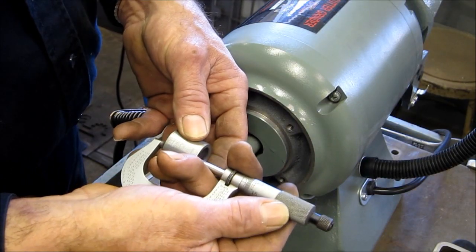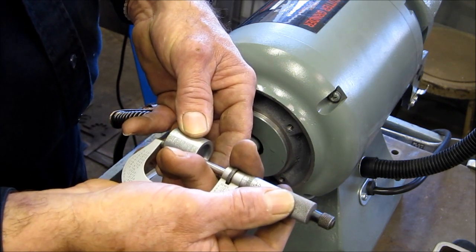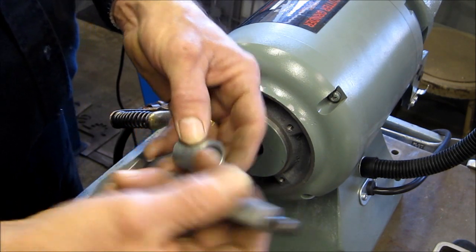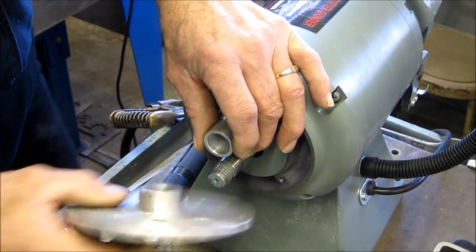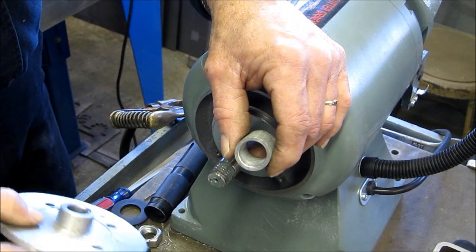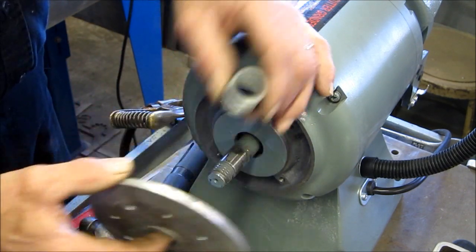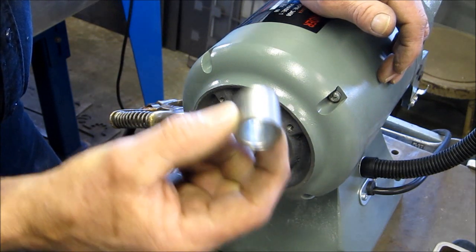One to two mic here. Let's find the narrowest point. We got 39 and a half there and about 180 degrees from there we got 144. So if you don't have parallel surfaces on this, when you tighten and put the compression against this piece, this plate is going to follow this surface because that's what you're tightening it against. No matter how strong the shaft is, the shaft will also bow and flex to compensate. So the biggest mistake and the reason this is running out is because this sleeve is not parallel from end to end.